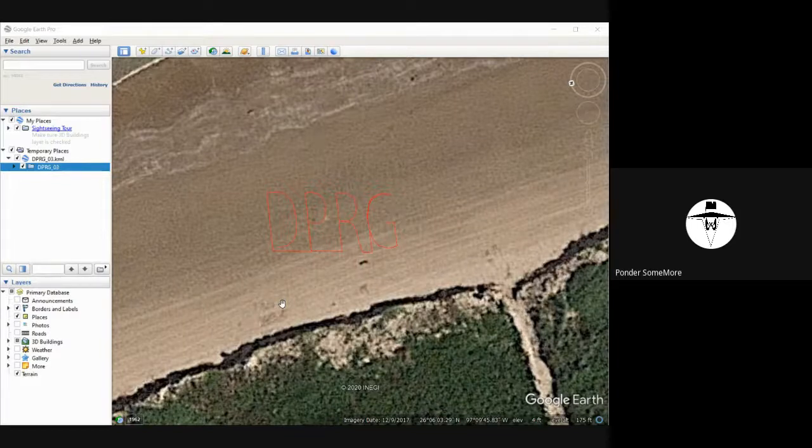There was another video that I didn't show with the rake. Another fail was that when we're going over very dry, loose, very fine sand, it digs in. The rake sort of pulls down underneath the sand, and it gets a big pile of sand building up over the tines, and it basically stalls out. The wheels are spinning, but it's not moving anywhere. So it is very sensitive. The sand that I was going around on was close to sea level, and it was fairly wet.